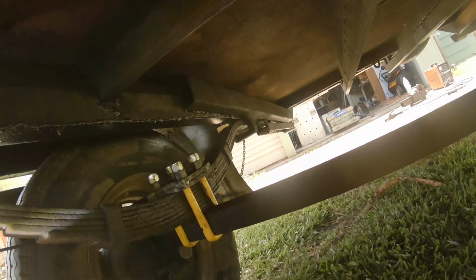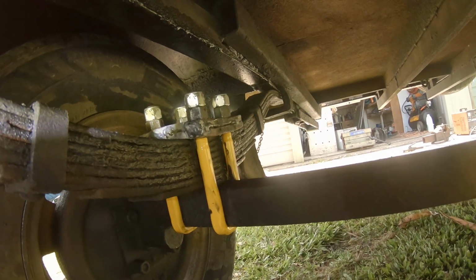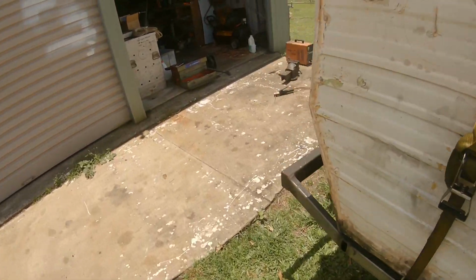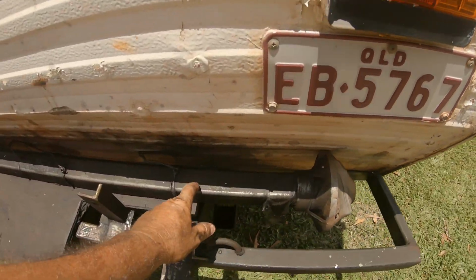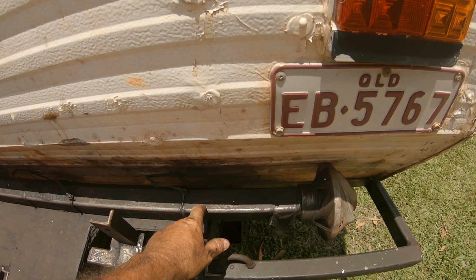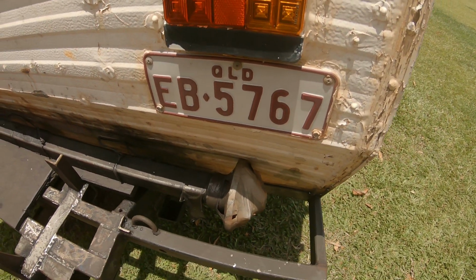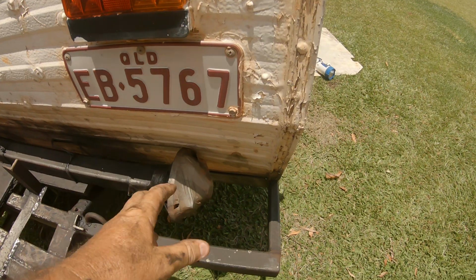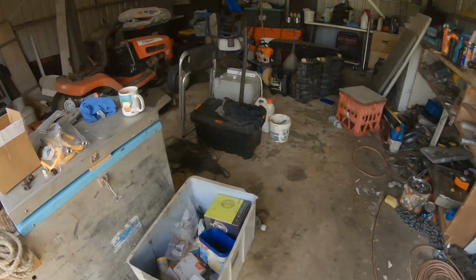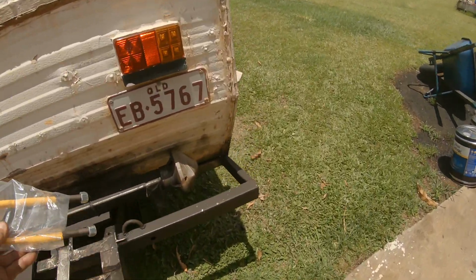Oh, I love the look of that. Double lock nuts. Yeah, now I've just got to buy a couple more plates. But I carry a spare axle on the back here. It's 50mm box, 5 or 6mm with a stub axle up the guts, and they're only Falcon bearings with Holden nuts. And I've got a spare set of nuts on there, and they're the 50mm ones. I went up and I've got them for there.